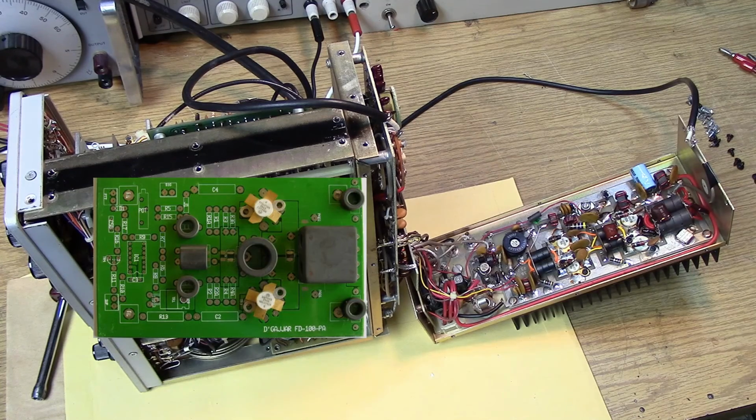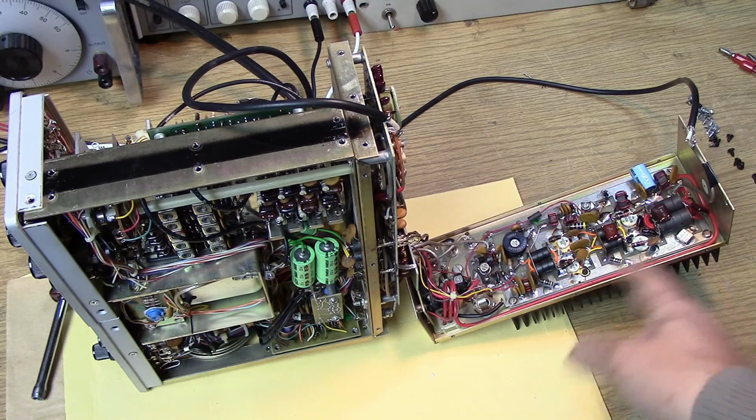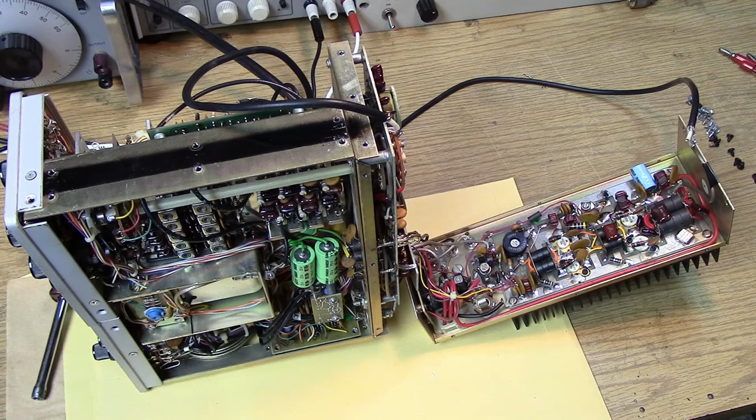So it's a great 12 to 14 volt type thing. Works great in the car, and you don't have to go crazy with the biasing. You can use a 723 regulator, any adjustable regulator, or in this case, they use diodes to basically forward bias a diode, and it gives you some adjustment of the bias that tracks with the transistors.